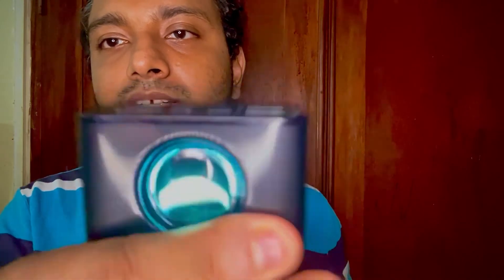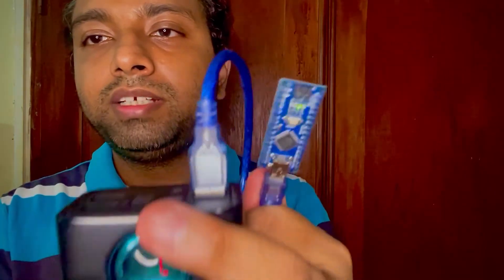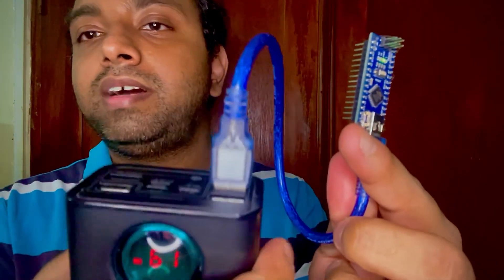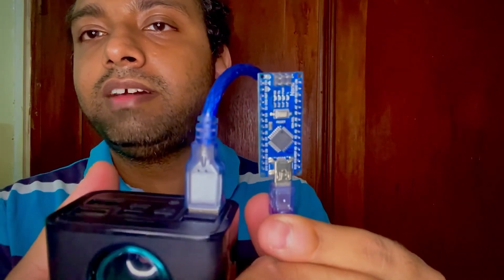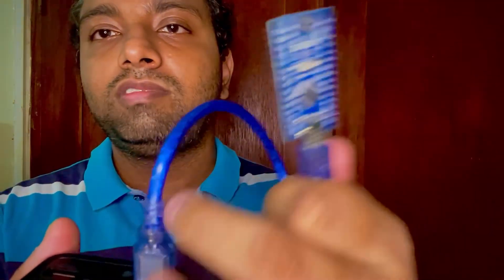You must make sure that you turn off lock mode when you're done. You turn off power lock mode by pressing and holding the button until you see the '88' display, then release — and you can see the power bank turns off and will no longer provide power through USB. That's how you power small, low-power-draw modules like this from this kind of power bank.